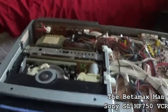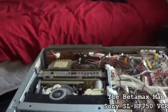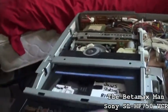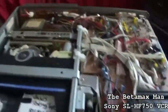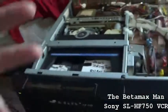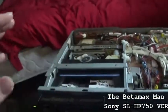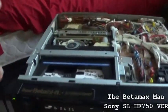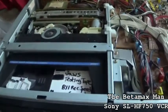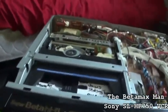But like I said, I think the smoke was due to the piece of vinyl tape that was getting hot. I probably shouldn't have used the tape. I probably should have just left it, because what I had to do is tie two caps in. There's a capacitor on one side, and on the other side I tacked a second capacitor to give me the voltage that I needed, because I actually needed 63 volts at 47. So I took a 50 volt at 10 microfarad and a 16 at 47 and connected them together, so that's 57 microfarads and 66 volts. So we're only going up on the voltage by 3 volts.